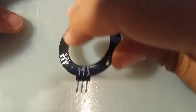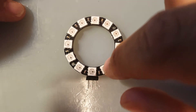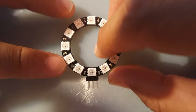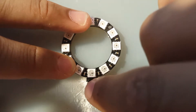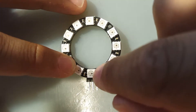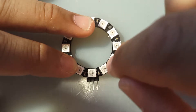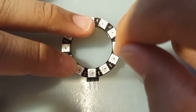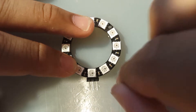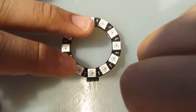How do you know the order - how does it turn on? These LEDs have a little IC chip in them, so they're basically smart LEDs. They're connected in serial, so the first LED connected would be number one, the second would be number two. How do you know which one is first? If you have a strip, it's the first one right next to where you connected the IN. With this circular one it's more complicated - we won't know until we go into Betaflight.